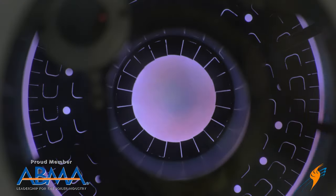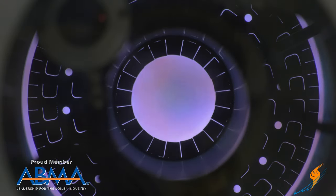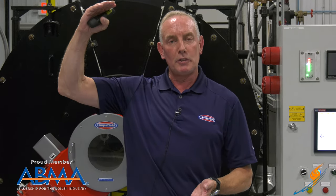That allows me to get the right flame speed, the right gas metering, and 3% O2, which is our guarantee at all times. We want that 3% O2 at high fire all the way down to low fire. That's the guarantee that we're offering and that's what we're trying to achieve.